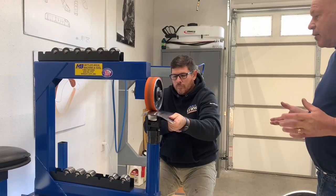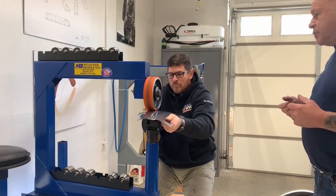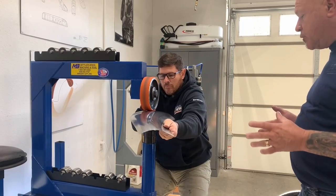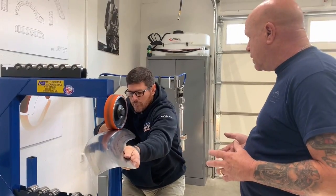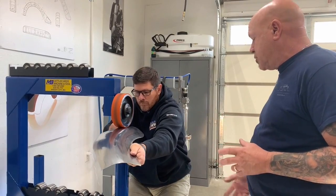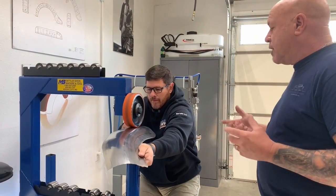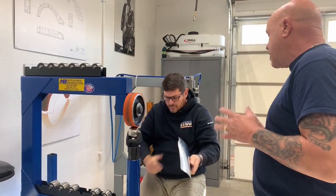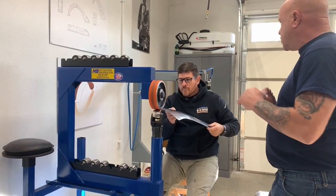And so whenever you're wheeling the panel, whenever you're doing anything in the wheel, as in doing rubberized wheel forming, or if you're doing linear stretching with shaped wheels, the idea is that you keep an eye on where your marker indicator is, so that when you come to do the other side, you know exactly, oh, the pressure should be here. That's why we have a dial indicator on there. So that you come to do the other side after you've done the same motion through the large wheel, you come back to this one and think, yeah, I need this X amount of pressure to give me the consistent forming. Not too much that it ribs, not too little that it takes too much.